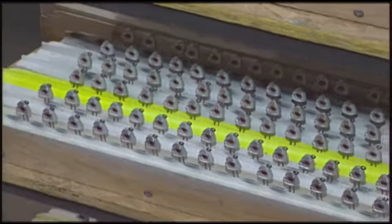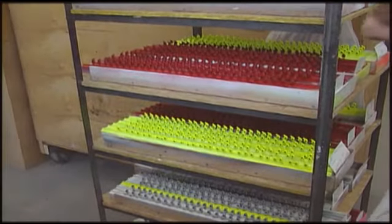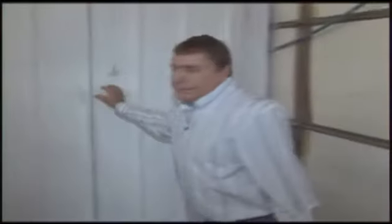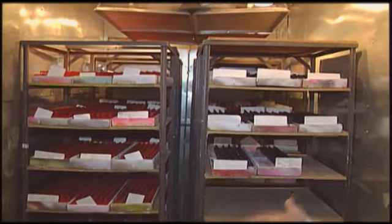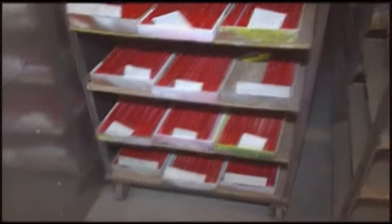On this cart, all the eyes have been dotted — we've already put all the eyes on them. They're just waiting for the very last step, which is an epoxy top coat — a clear coat. So these will get clear coated back in the paint shop, same place we do the base coating and color coating. Everything that we clear coat today will go into what we call our big hot box. It runs all the time. Every day we're throwing in however much product — in this case, there's about six carts in here. It's a big dry room that heats up to about 100 degrees, circulates the air, and cures that epoxy top coat, so that tomorrow morning when all these carts come out, it's dried and ready to be packaged for shipping.